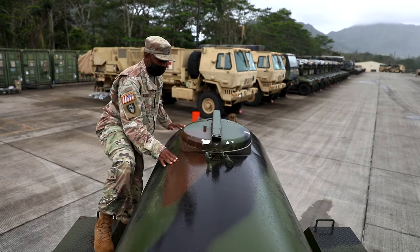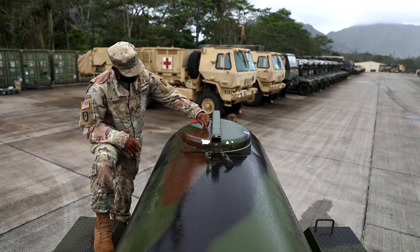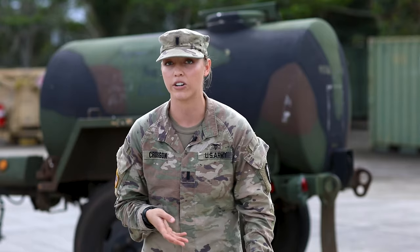From there we'll step up onto the sides of the water container to look at the manhole on top. The first thing we visually inspect is the pressure relief valve — the bolt that sits on top of the manhole cover — making sure it's intact and not rusted through. Sometimes we see those bolts so rusted through that it ends up being a tiny little hole straight into the water container, which means insects and other things can actually get inside.